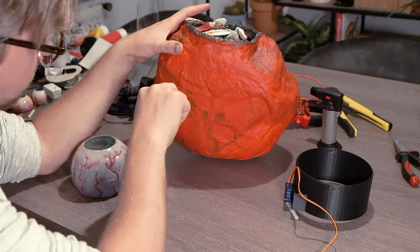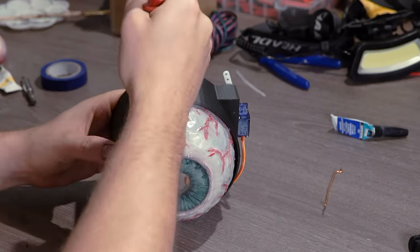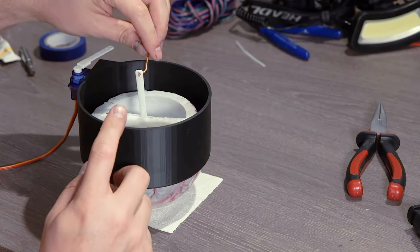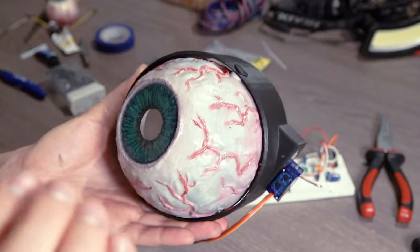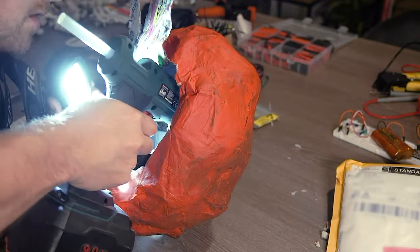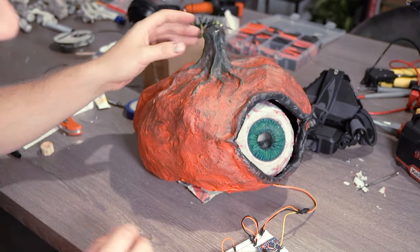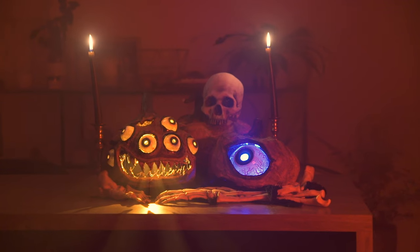Let's now move on to finalizing the one-eyed pumpkin. First I removed its guts through the eye and through the bottom. Then I added the 3D printed plastic pins to hold the eyeball in and it should be moving freely. Then I added some super glue to the extension arm and added this to the back. Then I made a copper connection wire, added it back to the servo motor and everything worked as expected. Then I used some pieces of cork that I glued onto the base and onto the pumpkin to center the eyeball. I used hot glue extensively here because the eyeball has quite some torque if it moves left and right — I wanted it to be properly fixed. After that I added a step-down converter to have the servo run on 6 volts like the other pumpkin. I rewrote the code in combination with ChatGPT to have the pumpkin eye move slower and more surprisingly. And with all of that done, this is my final result — I am super proud of these.